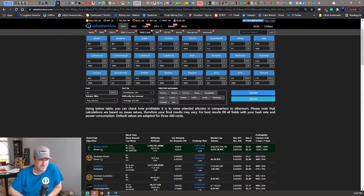The other thing with the solar that really helps is the fact that there's a demand charge that gets calculated on the highest demand hours of the summer. With solar, that demand charge always ends up being lower. So last year, my monthly demand charge was like $17. Since the beginning of June, it's now $5. Now that'll probably change next year because I added a whole bunch of mining rigs at that point. So I know my demand charge is going to be higher next year anyway, but still it'll be much lower than it would have been. So anyway, I didn't intend to go in on that subject, but I appreciate you guys bringing it up.